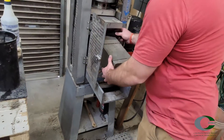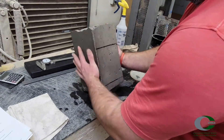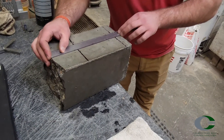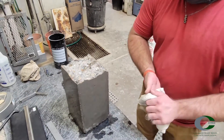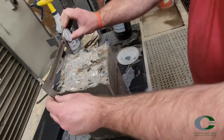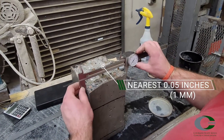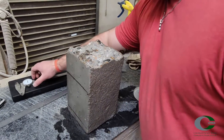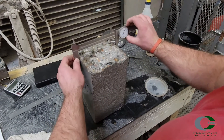Remove the broken beam and verify the break is within the middle third of the beam length. If the rupture occurs outside the middle third of the beam by more than 5% of the beam length, the test must be discarded. Take three measurements in each direction at the rupture point — at each edge and at the center, both vertically and horizontally as the beam was oriented for testing. If capped, the capping material should be included in width and depth measurements as applicable.